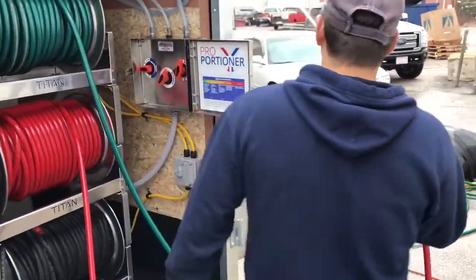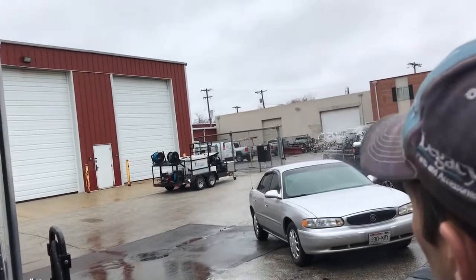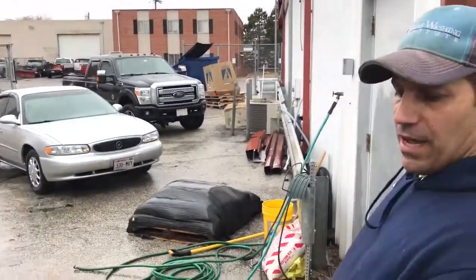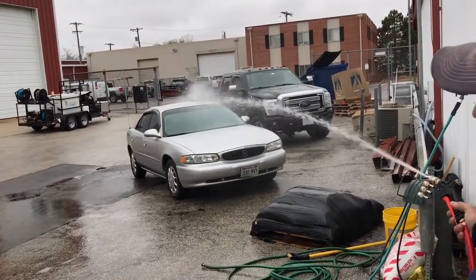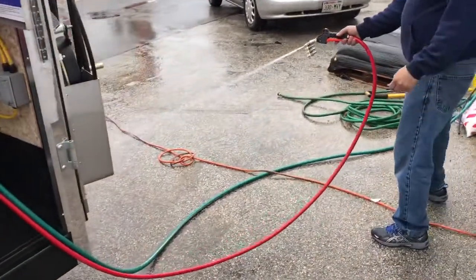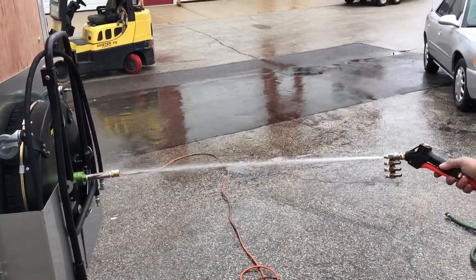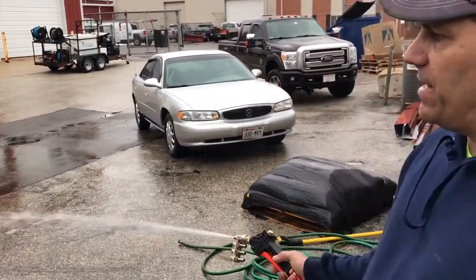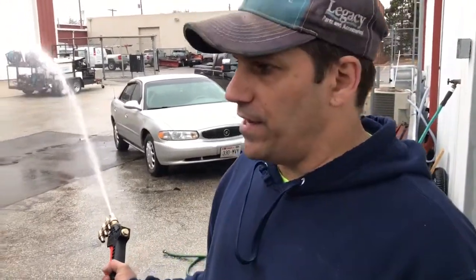So now I can continue to spray — there's my booster pump, getting the distance I want. Now this is just water so we're okay. When I want to rinse, if I'm all done and I want to rinse, all I've got to do is hit the A button — I don't even have to come back to the truck — and then I can rinse everything out of the line and flush with water. You can see this has the capability of pushing a fair amount of dirt and rocks just from the water pressure. What it does is it takes your inlet water pressure and boosts it by about 120 PSI, so you can get as much as 250 PSI coming out of the booster pump when you use the force fed system.